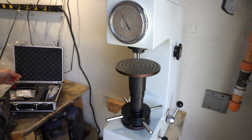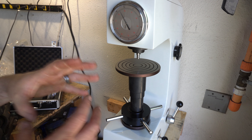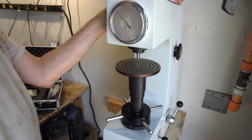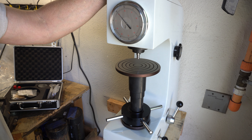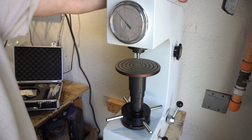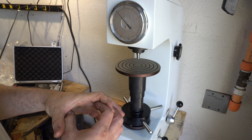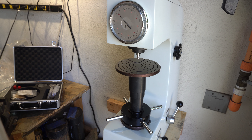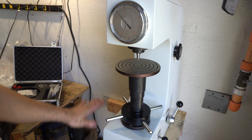When you get one of these machines it takes a little while to get it ready — there are a bunch of plastic shipping blocks inside that you need to remove. The Grizzly instructions aren't great; the pictures are fuzzy and hard to follow. It took me about half an hour to set up. You also need a table with about an inch-and-a-half hole in the bottom because the piston goes through on larger pieces. I built a separate dedicated table since you're not supposed to move or shake it.